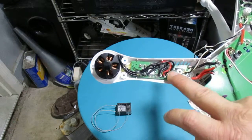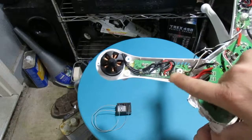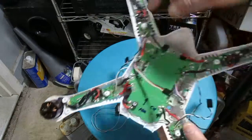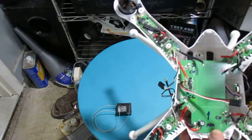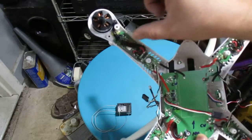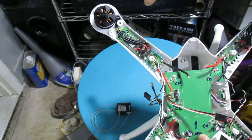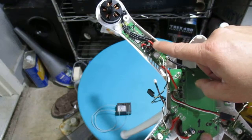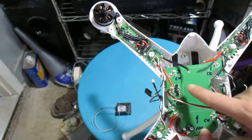Another thing I had to do: the wires coming off the motor had 3.5mm bullet connectors, so I cut them off and extended each wire. The way I wired these terminals coming off the motor is I had the red in the front. If the board is facing like this, you aim the motor straight down — now you're looking at the left, right, and middle — and it's pretty much wired straight to the motor. I used the red as the middle wire.